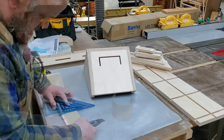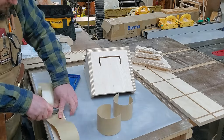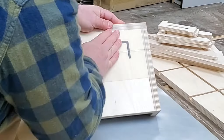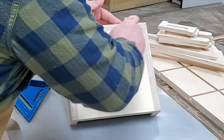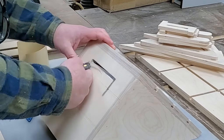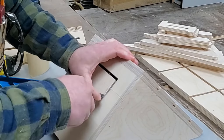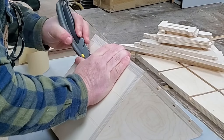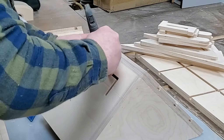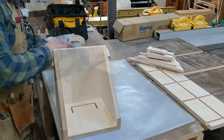Since this could also be used on my table saw as an independent tenoning jig, I decided to put UHMW — that's ultra high molecular weight — these little strips I bought at my local woodworking supply store, available in a roll. These are fantastic for the bottom of jigs and fixtures because they add little to no friction and make things slide super smooth. Three strips across there, angled so that when it's used independently it will slide with the saw. I also cut a little notch so the bolts and hardware used to mount it will have a place to go. That stuff cuts super smooth with a box cutter — makes a world of difference, especially for wooden drawers where it's wood on wood.